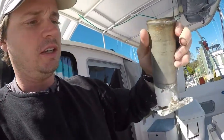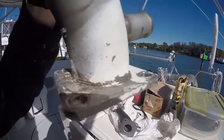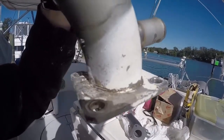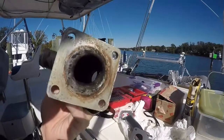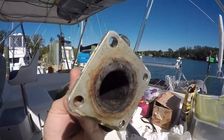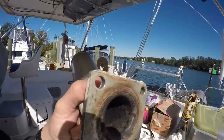You can see this is the old one I've pulled off. You can see just a little bit of scoring and what appears to be some really small cracking that I think has led to the leak. These things go through quite a lot of temperature change, especially if the engine starts out cold in the winter. Yanmar lists them as consumable — depending on the engine they're $150 to $200 a piece. I got both of them and the backing plate for about $450. It's a couple hour project and it's not too difficult, so let's get started.